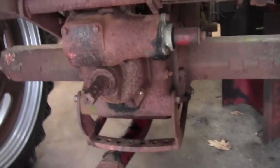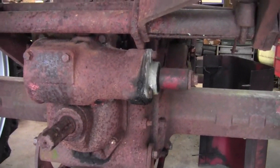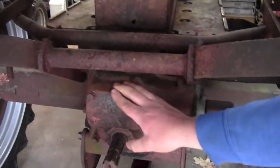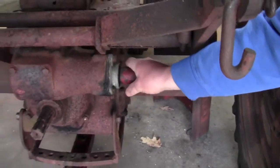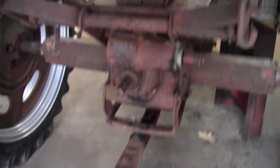Before we cut away here, before I forget, we can talk about that. What is this little gearbox with the bearing sticking off it here? Obviously, this is the PTO shaft. And then you could put an optional belt pulley on it here. Take the spacer off and put a belt pulley on. It's obviously a 90 degree gearbox, but not all of them had belt pulleys.